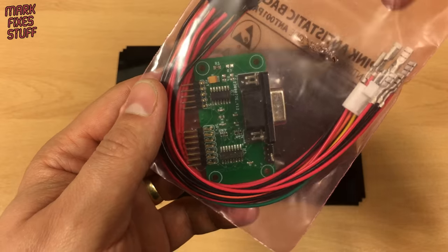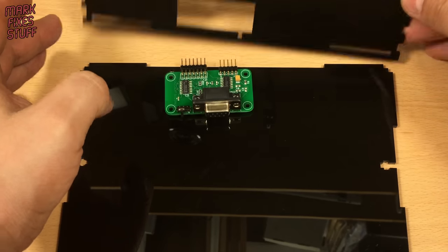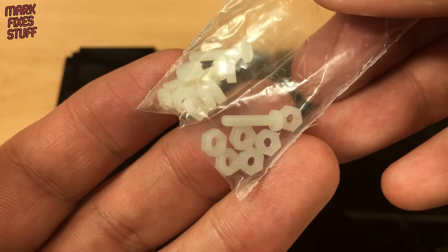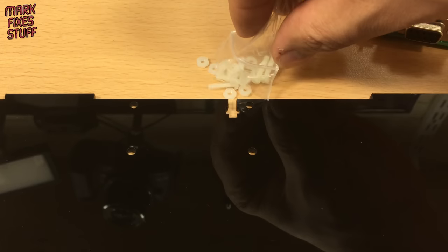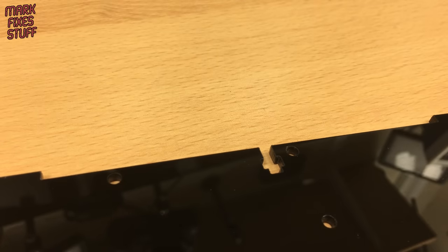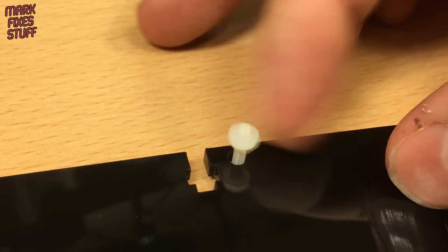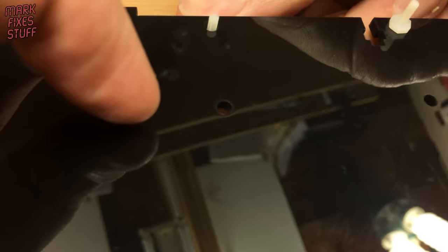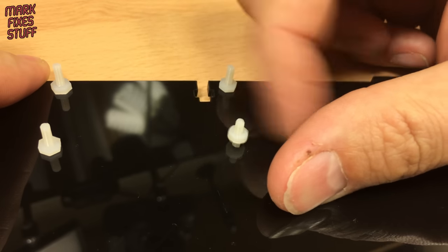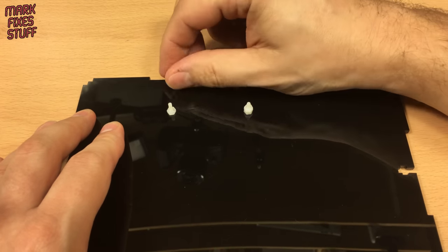First, we'll attach the board to the base panel. Empty the contents of the pink bag, making sure it's offset to the left to match the hole in the back panel. We'll need to use the nylon nuts and bolts for this. Grab your bag and empty it onto the work surface. Taking one of the bolts, pop it into place from underneath. Once it's through, use a nut to fix the bolt into place — using your fingers on the nuts is fine. Once all the bolts are secured, put a second nut in place for the spacing. Every bolt must have a pair of nuts.